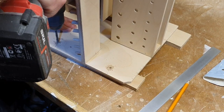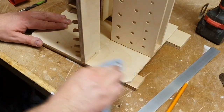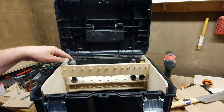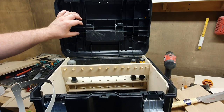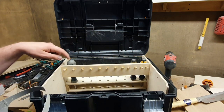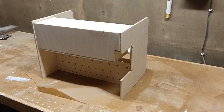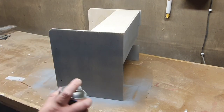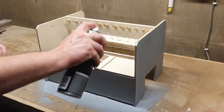I'm drilling two 4mm holes which I'll use to attach the paracord handles. I closed the box with some of the bigger screwdrivers in it and had to snip out some of the plastic corrugation in the top of the box. Those longer screwdrivers had to live in those specific holes in the box, but it's easy enough to remember because there's only 2 or 3 of them that are too big. I'm just going to apply some grey primer now, using a piece of scrap plywood to stop the spray paint from getting into the areas where the dividers are located.